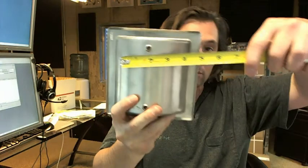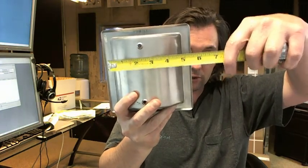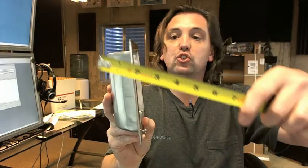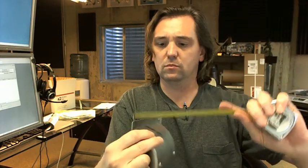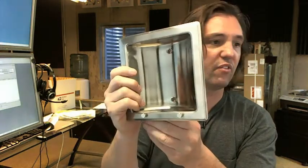Available with a back clamp if you are doing a drywall installation — that would be the 9353-55. You need the dash-55 and that will give you the clamp for the back that connects to the machine screws here, and as you tighten it, it draws the clamp in. Two inch depth — you are going to need a rough opening of five and a quarter by five and a quarter, and two inches deep. You will attach this to the back of a stud that you find in the wall.